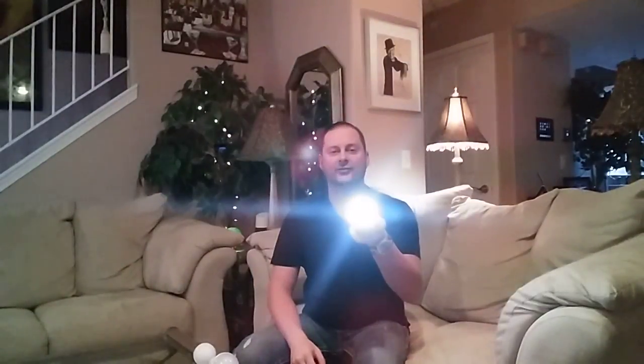The Safe Lumen is actually small enough where it will fit in some of those smaller lights or fixtures. The venting is really great on the Safe Lumen — there's a huge vent right through the middle of the bulb. What I like about this particular bulb is it has a power test button. You press and hold it and the light will flash one, two, and three times, showing you there is a 100% charge on the battery. Two flashes means 50% charge, and one flash means you need to charge it by turning the lamp on for six hours to replenish the battery.